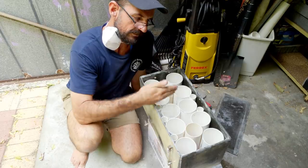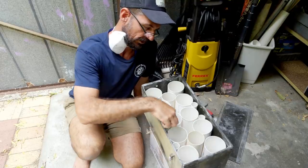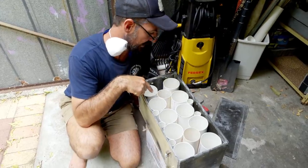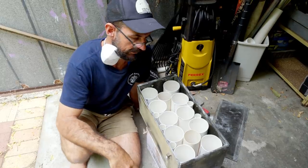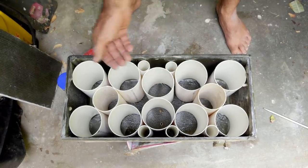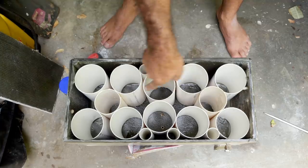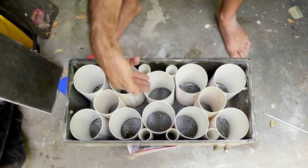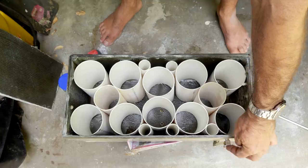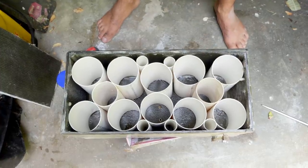So I've retrofit it, and instead of building new baffles, I found it was just easier to get 90mm PVC pipe, cut it to the length I want, and jam it in there. I've got some other sizes just to make sure it can't move. It's a pretty rough job so the diesel can get all around these, but they'll act as baffles — a little retrofit. I got the cuts fairly square, but I knew it wasn't important because you actually want gaps underneath. Diesel is so thin that it will have no problem flowing underneath, and that's how baffles work — you can't have diesel transferring through the sides getting momentum and sloshing. It has to have a tortuous path wherever it wants to get to, so there's nowhere here where a big bit of diesel will slosh.